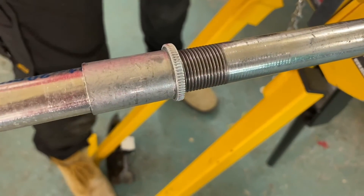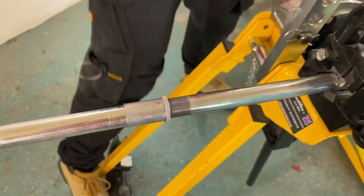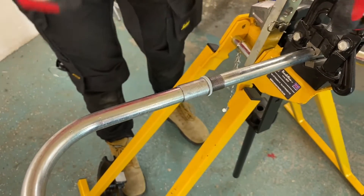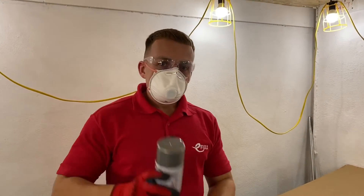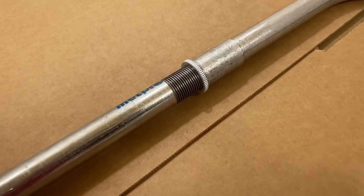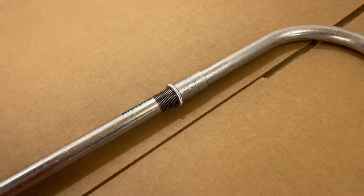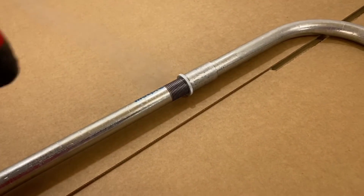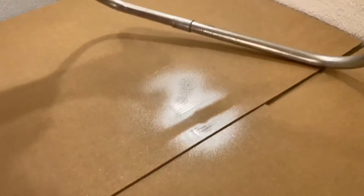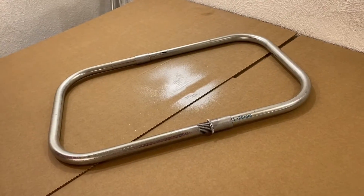What's the issue now with these threads that are left behind? If we leave them as they are they could be prone to rusting. So what we'll need to do is spray them with some galvanising spray. Shall we take that over to the bench? Zinc galvanising spray in order to prevent the corrosion of the conduit afterwards — it's really important. Let that dry.